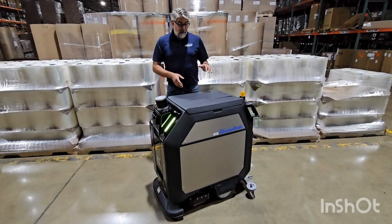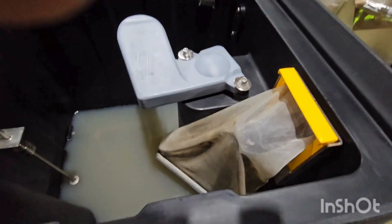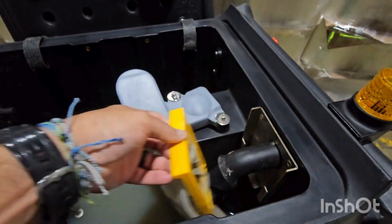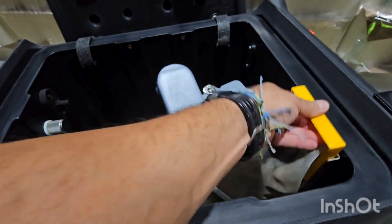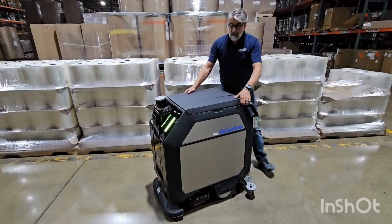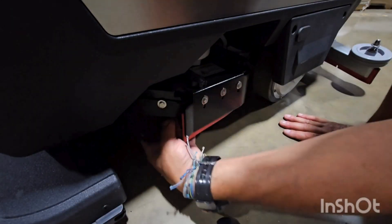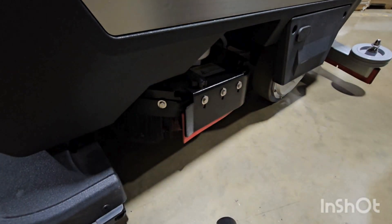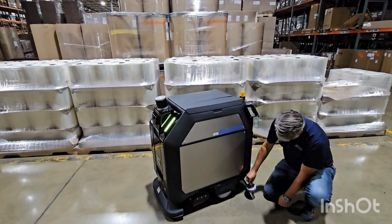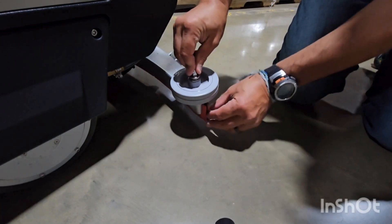There is a little bit of human interaction that's needed. There are a couple of maintenance points on this machine. In the recovery tank there is a catch bag that catches any large debris on the floor. You also need to check your pads periodically — these use magnetic pad holders, so they're very easy to get on and off. And then your squeegee blade needs to be flipped and checked, which is very simple as well. Simply press this bolt down and the blade slides in and out for an easy, quick flip.